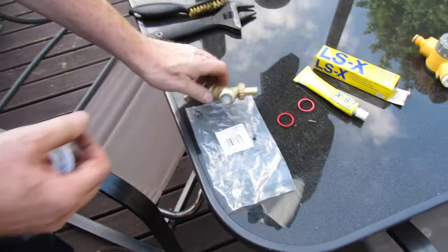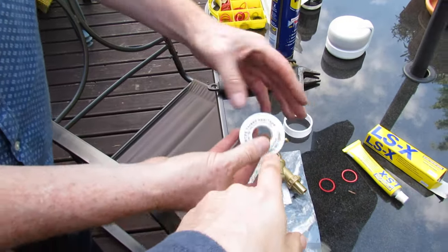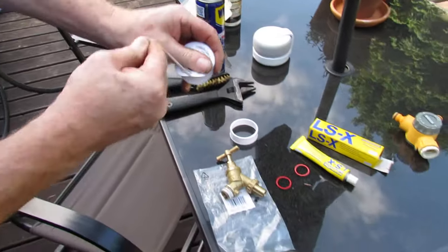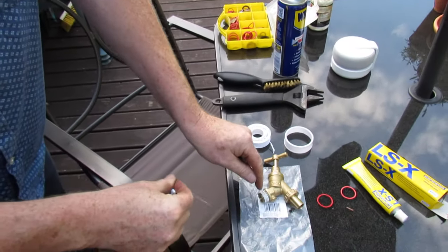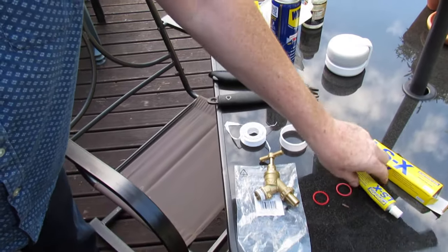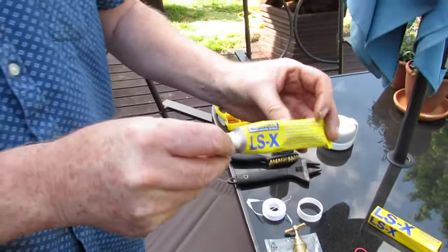The end of these has a new thread. What you want to do is use PTFE tape - that's about a pound. You pull the piece off like that, twist it round, and put it in between the threads. Don't put too much and don't put too little - just thread from the first to the last thread.